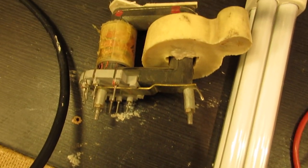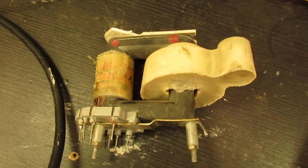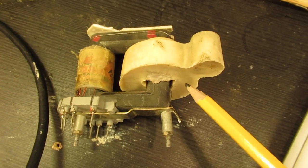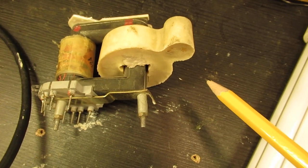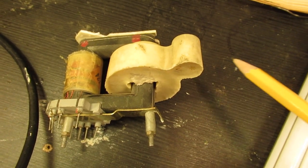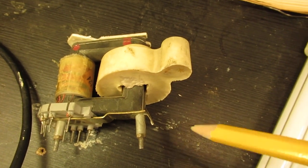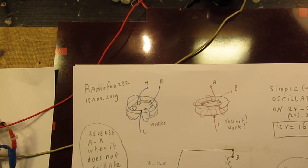And of course, you can also use this circuit to drive a high voltage transformer, a flyback transformer, that works very properly. Of course, be very careful with the high voltages on the secondary. Very, very careful. Don't charge high value capacitors via a diode circuit. That can be lethal anyway. And I don't publish that circuit on purpose, because it's not very safe.